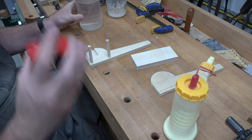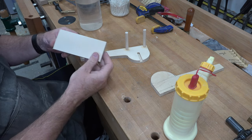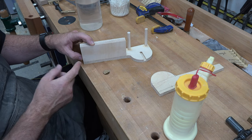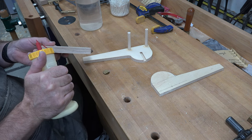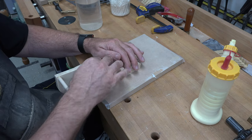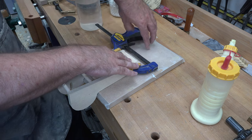We can clean up the squeeze out around the dowels. Now we want to glue in our writing surface. This writing surface is going to be glued in so that it is completely flush with the slope that we cut, so make sure that it is and glue it in place and clamp it up. We'll add glue here and get the whole assembly glued up. I'm going to use a piece of three-quarter inch MDF with wax paper attached so we can sit this in place, clamp it up, and be assured that our bottom edges are going to align.